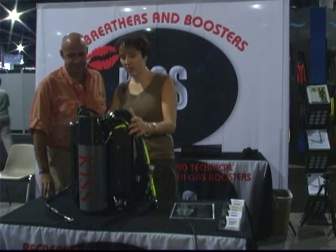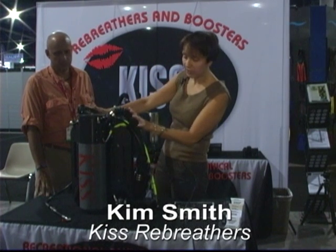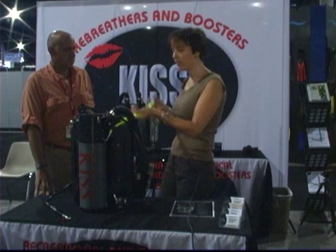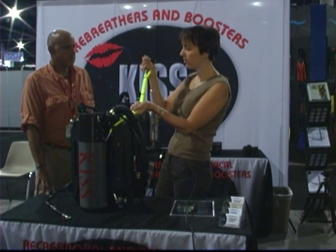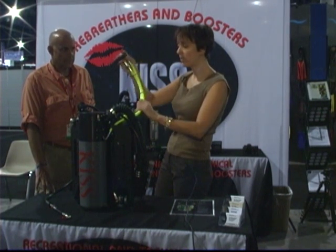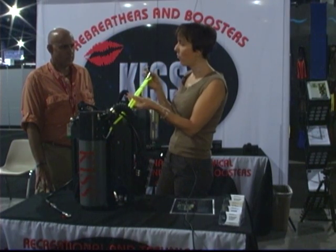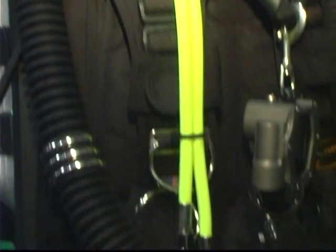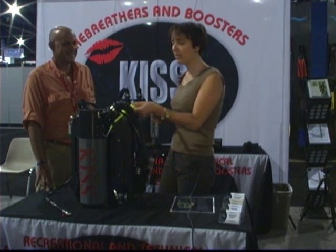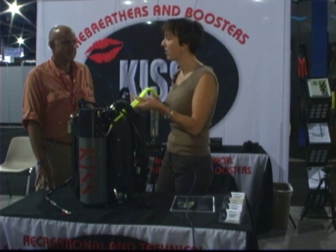I would love to, Jeff. This is our classic KISS unit — the one we've been selling for over 10 years now, and there are a few changes. The most popular is the addition of the MiFlex hoses. These are soft hoses that still work if they're twisted. They come from England and are rated for oxygen, helium, and nitrox mixtures, as well as air. We moved to these because this is the only hose I could find besides the Swagelok hoses that are rated for oxygen.